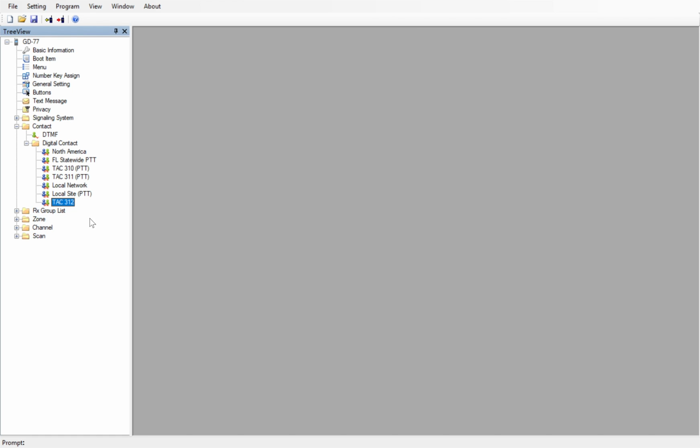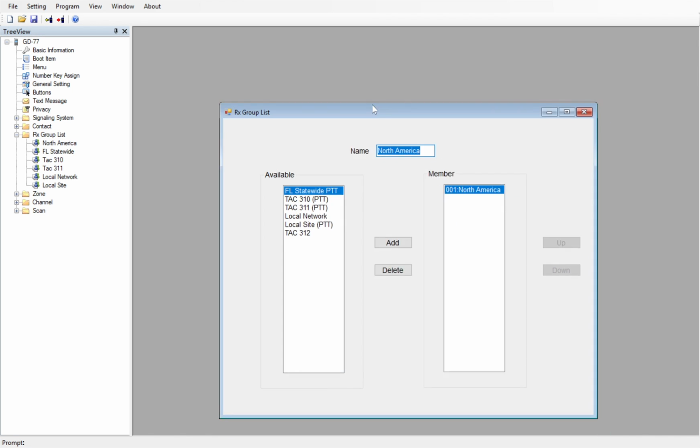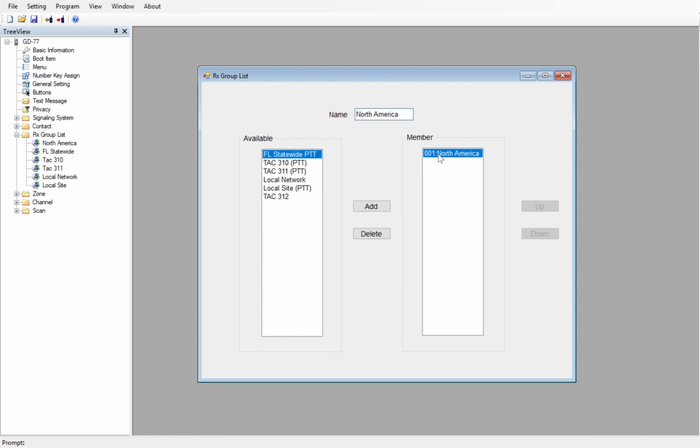I don't do that. So now we have our talk groups here, the contacts. This is the one we just added. Now we have to make a group list, because with the GD-77, until they fix what I believe is a bug, you have to have a group list. I'm on North America a lot, so we'll use North America as an example. I have a group list just for North America. So when I have this selected, I don't hear anybody except people talking on North America.